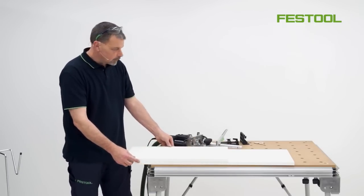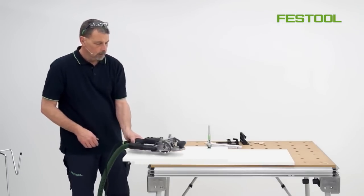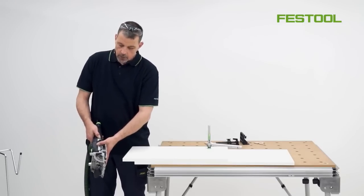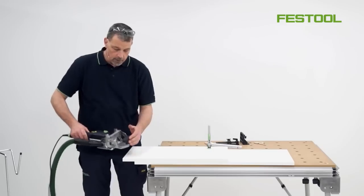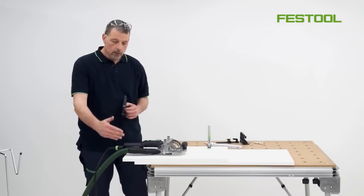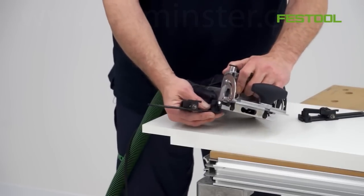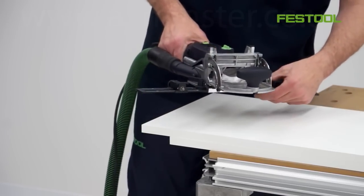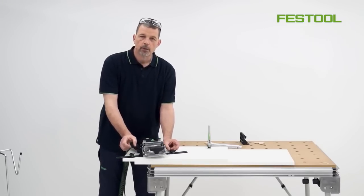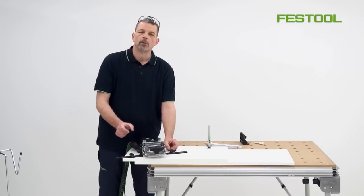We can bring the two components together in this position and clamp them down. The first cut we make will be into the top, so we keep the depth of cut at 25mm. We can also keep the 10mm setting for the height of cut. I want to make sure that my dominoes are equally spaced, and this is the big advantage of using the cross stops. We can fit these onto the base of the domino, lock them into position, and then accurately adjust these to have our domino in exactly the right place.